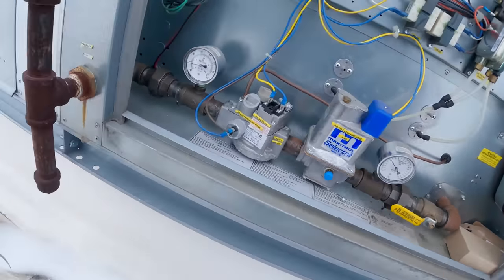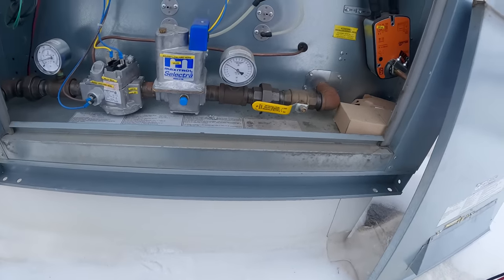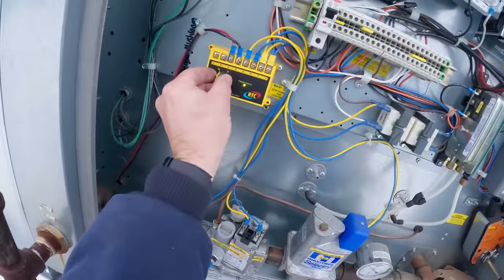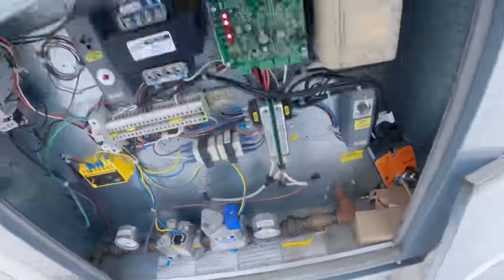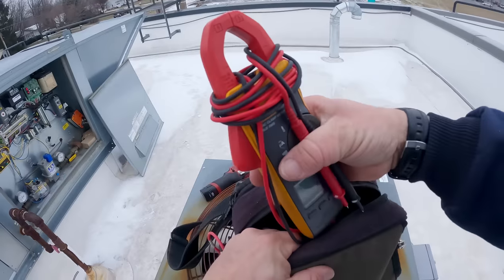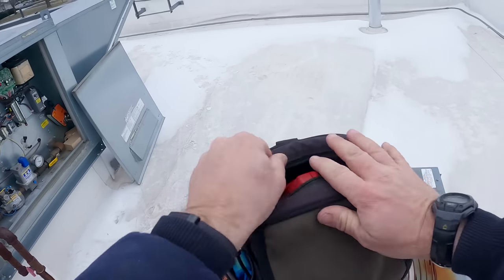I always love it when they give us a nice reading like that. Manifold's not very high, but it's not hot-firing probably too hard. We're only going for 60 degrees here on that — which in a kitchen, 10 degrees below room temperature, it's going to feel good and cool. Let's go down and see how that does as far as the doors opening and closing and whether or not we're sucking all the heat out.